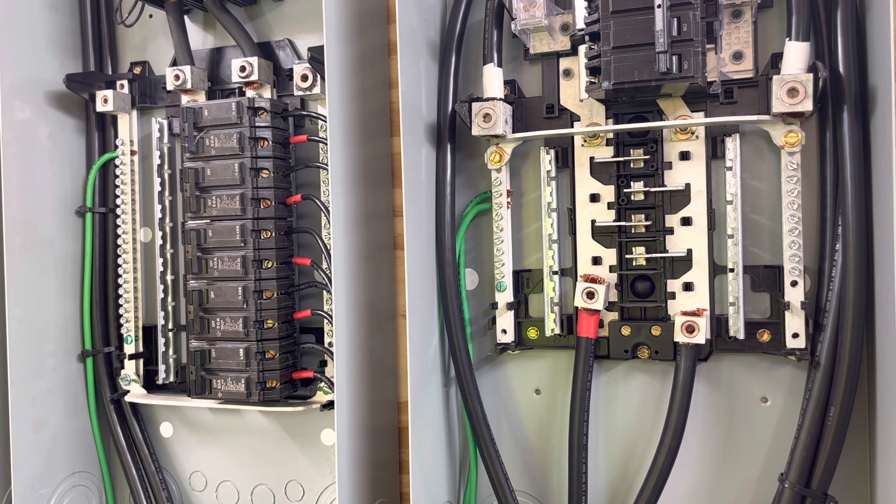I hope this has helped you a little bit. I know it's a very short video and I don't have anybody helping me record this. But the isolation transformer eliminates all those issues. It does introduce a little extra line losses and a little extra expense, but it's going to give you a safe and properly working system. If you've got questions or comments, leave them in the comments section. Have a good day.